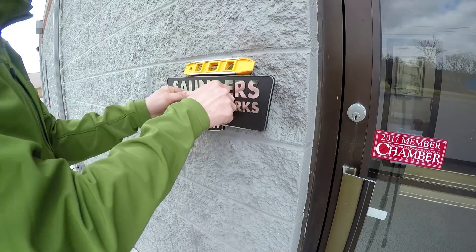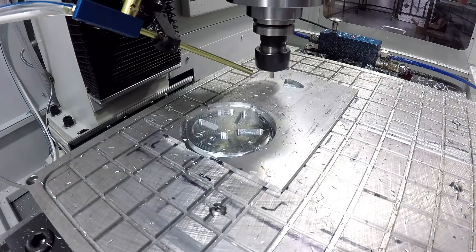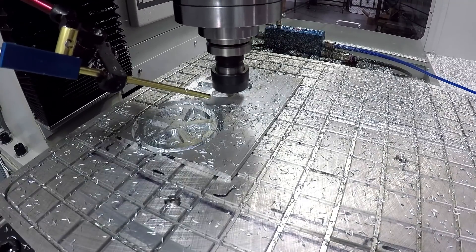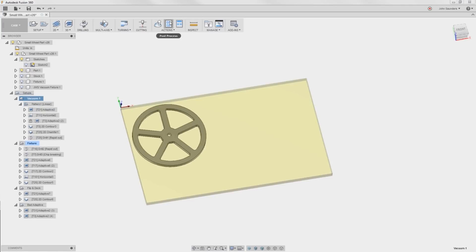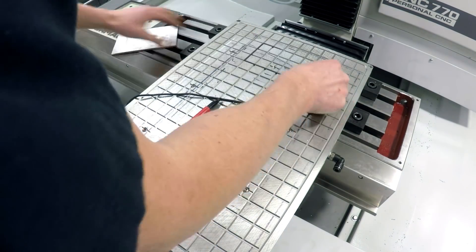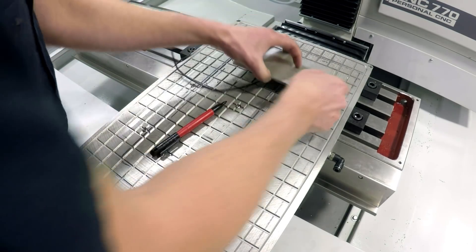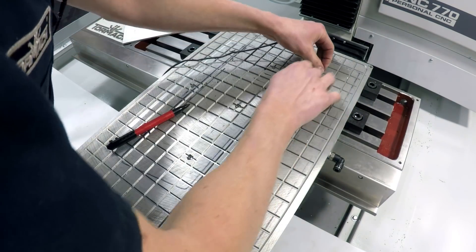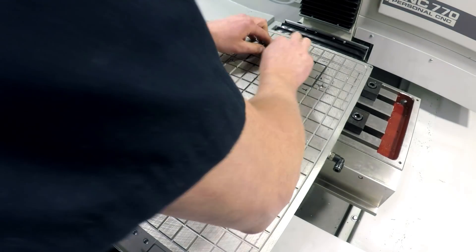That sign is almost five years old and it still looks great. In Widget 138, we had to make a pair of wheels, and we spent a good amount of time talking about the CAM strategy, how we were going to fixture them, and program the tool pass — including the use of cutter comp. A classic trick for vacuum work holding is that if you have to make multiple parts, leverage the additional surface area of a larger piece of material. Just make sure you don't machine all the way through, or you will immediately lose all your vacuum work holding.